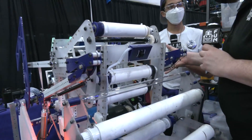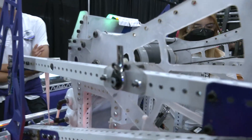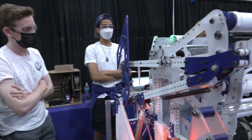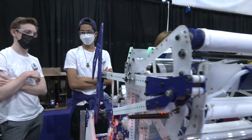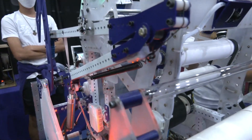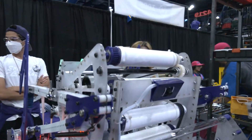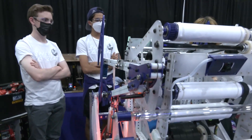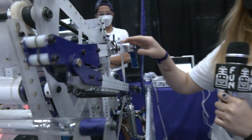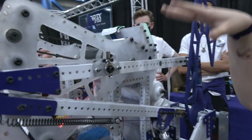To finish up with your robot, we're going to bring Janet in to talk about the climber. Janet, I noticed this broken wrench on here — I'd love to hear about the whole thing. Our climber runs on a winch system. We have two hooks and two latches on either side, and on the bottom it's connected through rope. Our winch system on the bottom wraps the rope around the tube. As we extend, when we release the rope, these are sprung up by springs on both the pivot point and underneath, so it springs up and then we go over the bar. Once we're ready to climb, we pull ourselves down like a pull-up. These are also powered by springs — this hits the bar, goes down, and then lands inside our latches. Once we're ready to let go, we just release, fall onto the latches, and then we're on the rung. These specific wrenches are cut ratchet wrenches — it's a way to tension the rope. We can just tighten it and it tightens the rope so we can tension it and make sure they're the same on either side.